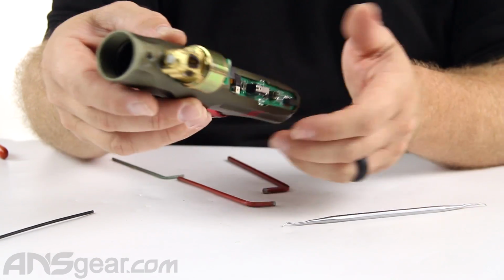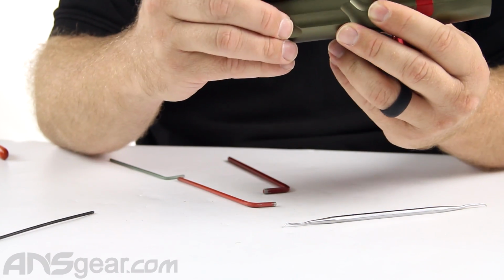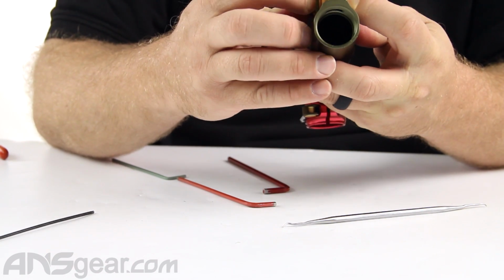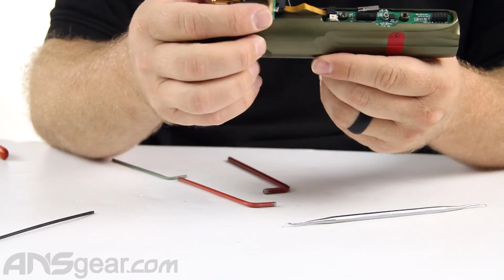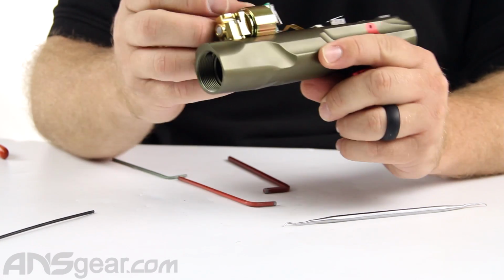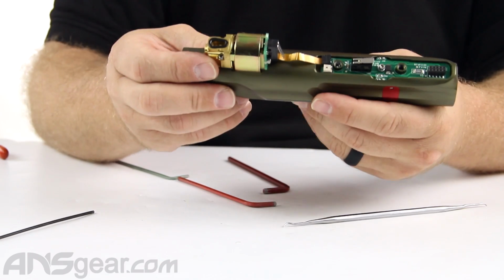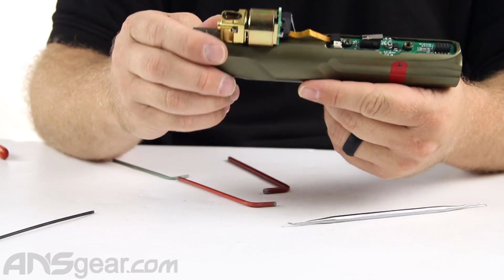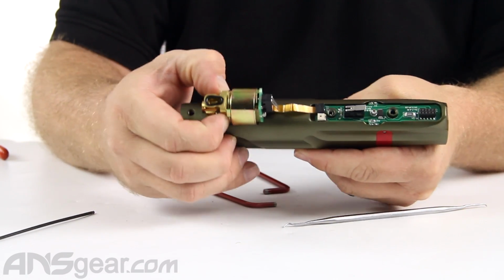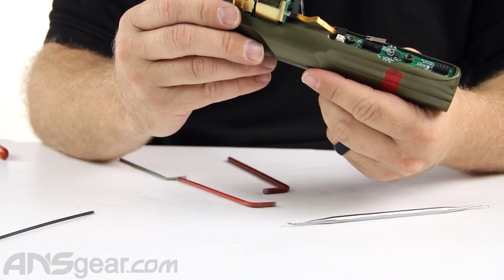Let's see right there. We have our solenoid assembly right here. And this is the same kind of solenoid assembly. Well, I'm using a very general term when I say that. The same solenoid assembly that you would see in like a Spider or something like that. It's just an electronically activated solenoid. It's not a pneumatic solenoid where air is sliding a spool back and forth. We are driving this thing forward with a current to get it to cycle. So let's pop this thing off here. We'll look at it.